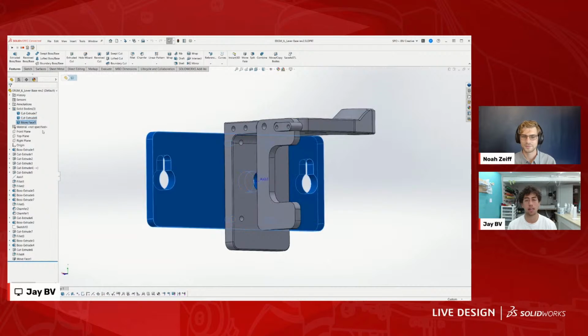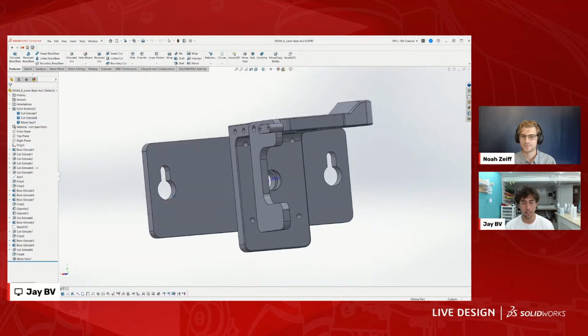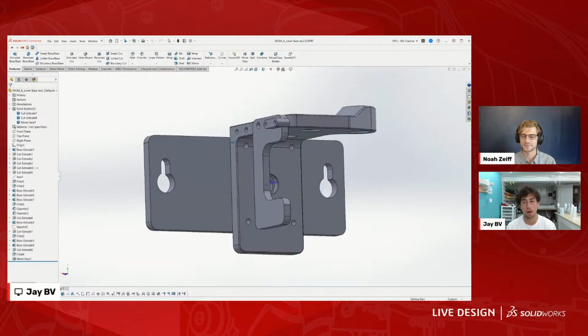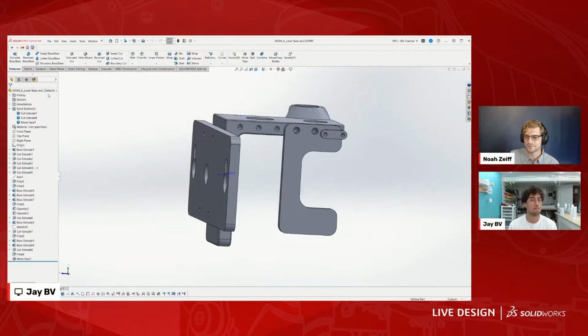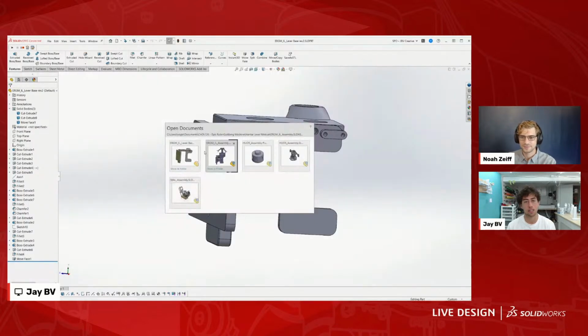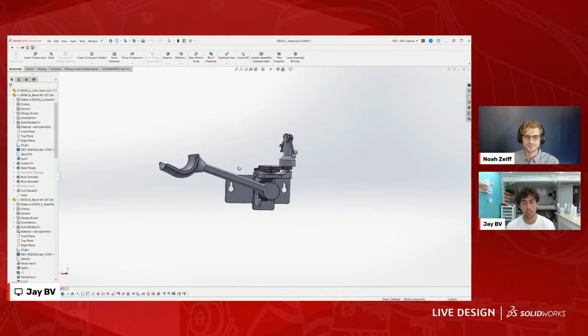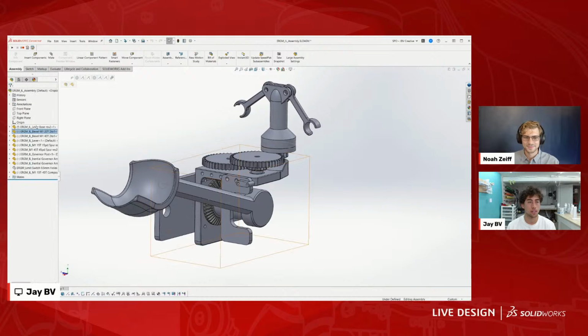And the reason why I do it like this is because these are static. I basically only assemble parts that are going to be moving in the assembly, and otherwise I use static parts. From what I understand, there's not really a best practice necessarily. There are so many ways to do the same thing in SolidWorks. Mm-hmm. And so this is just a way that keeps it simpler for me. Like in the feature tree here, there's just fewer features, and I find that helps.